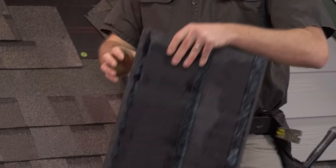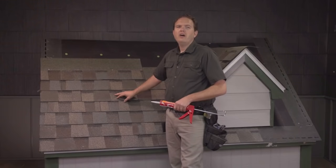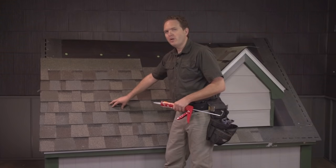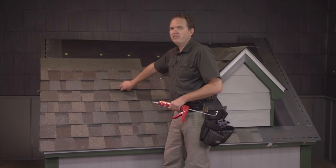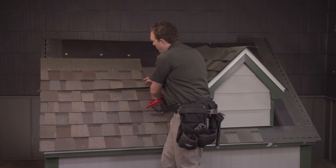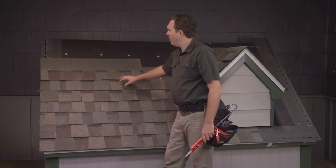When you're done replacing the shingles you want to apply some sealant to help the shingles glue back down. On this architectural shingle, the glue strip is located on the bottom at the very lower edge. The old shingle above will need to be glued down to the new shingle to activate the glue — when it heats up, the new shingle's glue strip will glue back down fine. However, the old shingle that we left in there has a damaged glue strip because it had already glued down and we broke that glue to get the damaged shingle out. So apply a nice fat bead of sealant all the way down underneath that old shingle and press it into place to ensure it's glued back down to the top of the shingle that we replaced.